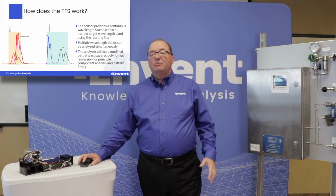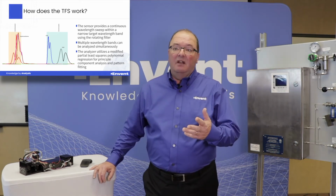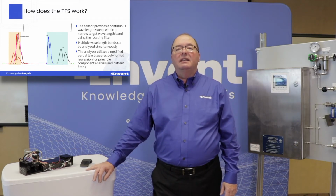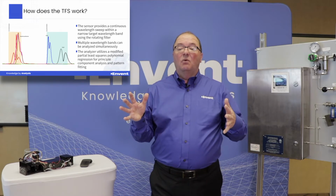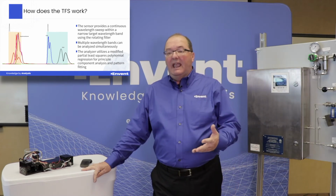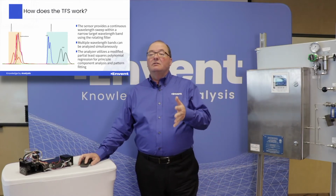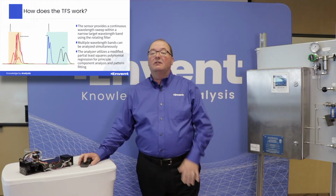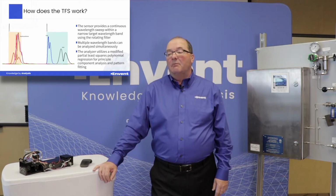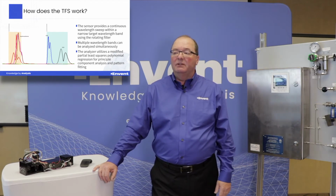those different components. The problem is, and this has always been a bit of a quandary as far as infrared analyzers go, that, for example, on the hydrocarbon stream, you can see that a lot of the absorption curves are overlapping. And so it was very hard to identify which was which and how big the curve was, because basically we're measuring the area under the curve to determine the amount of gas that is actually present in the stream, okay? So what we do is not only isolate those two specific wavelengths, we can see all those multiple hydrocarbon absorption curves, but what they do is something called modeling, or, in a fancy word, a modified partial least squares polynomial regression. I know that's a big word, but spectroscopists would be fairly familiar with that. Okay.